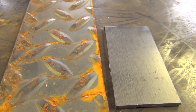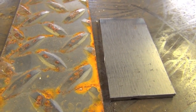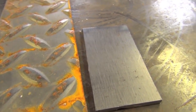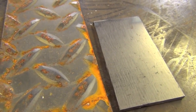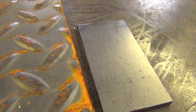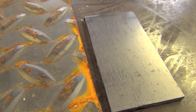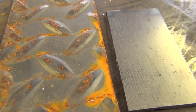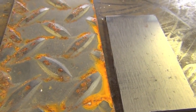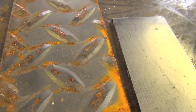In this series we're going to be working with cold rolled steel. Why? Because if I used hot rolled I'd have a lot of grinding to do. The piece on the right has a thinner coating on the material to keep it from rusting, versus the piece on the left which is a totally different color. The piece on the left has a coating of mill scale that is much thicker.